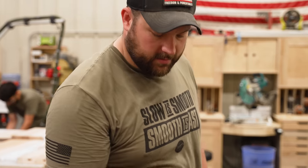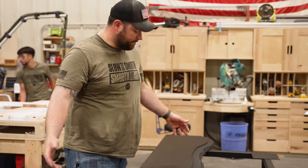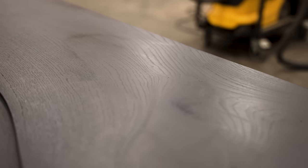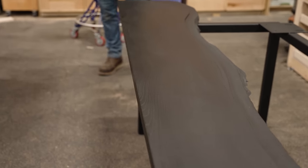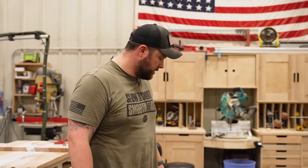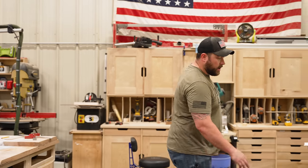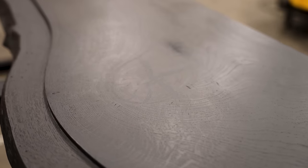I'm going to break something — mostly because I haven't used this product in a large application before. Things tend to have issues when you go bigger. We're having sheen problems on one side only; the other side looks fine. It seems like we had some overlapping in the pre-color application that caused issues. I love Rubio, but I'm pretty pissed off at the lack of instructions on the can for the pre-color application. The only solution seems to be sanding the whole thing down and reapplying — and this thing needs to be delivered in three days.